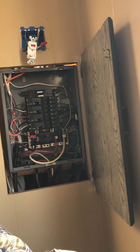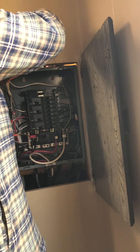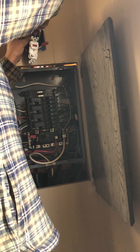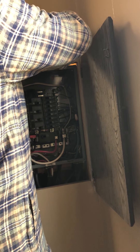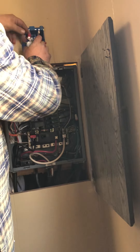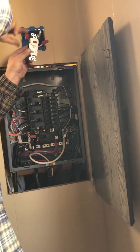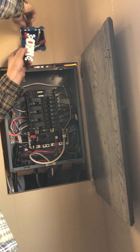Copper jumpers — yes, I do. So I take all my grounds, put them together, and put a wire nut on. I'm going to bring the little pigtail out like that, put a J bend in it, and put it on the ground screw in the direction of rotation.